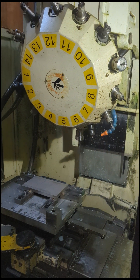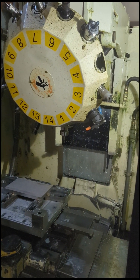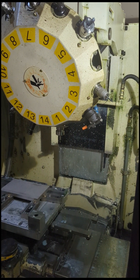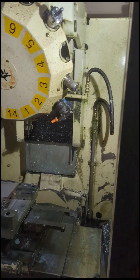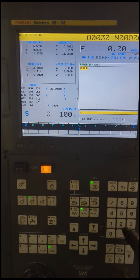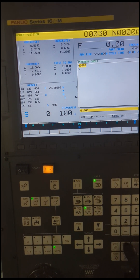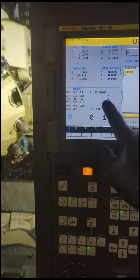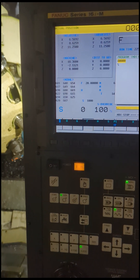Now to use a wobbler, what you need to do is put your spindle at about 1000 RPM. You can manually do this using the manual controls, but as always on CNC it's easier to just tell it exactly what we want to do — S1000 and insert.